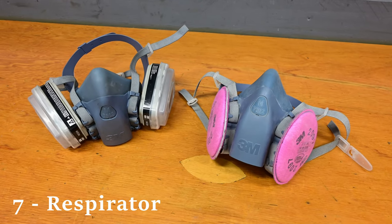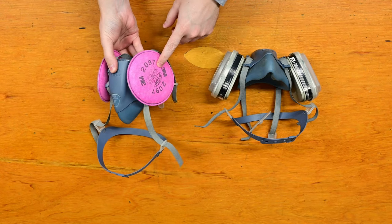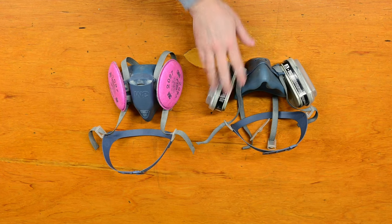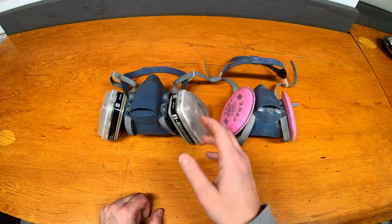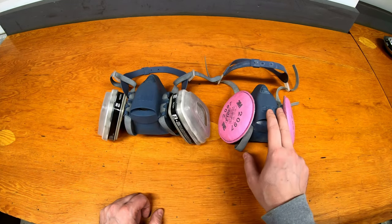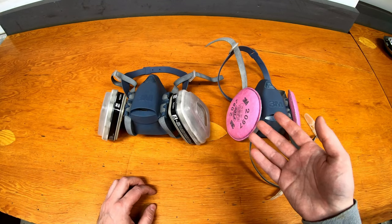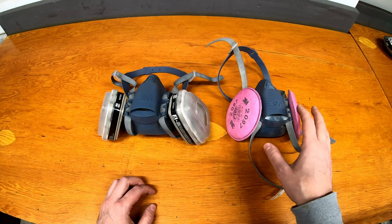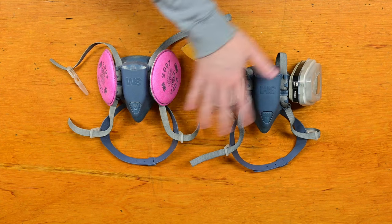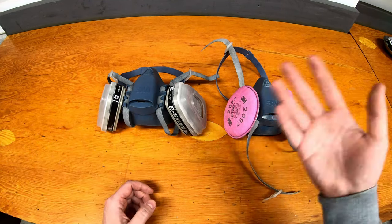At number seven is a piece of safety equipment — a respirator. If you're working in anything dusty, dirty, or painting, you really should be protecting your lungs. I have two different sets of filters here: the 3M 2097s, similar to the 2297s, which are designed for dust and particulate matter, and the 6000 series filters designed for painting. I use this mask for painting even with just spray cans, and this mask when I'm sanding, grinding, or welding. The masks themselves are the 3M 7500 series — extremely comfortable with a silicone seal around the face, much more comfortable than an N95 dust mask. You can wear these all day long, your glasses won't fog up because they have a downward-facing exhaust, and they really do a great job blocking dust, particulate, and fumes.